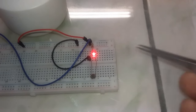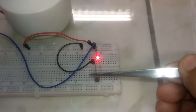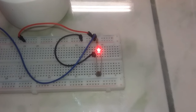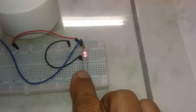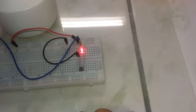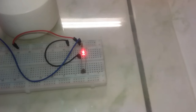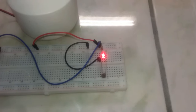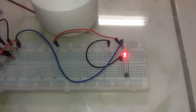A resistor is connected in series leading to the LED, and the negative goes through the LDR to light up the LED. The operation is simple: if we cover it, it is open; if we uncover it, it is open to the day and will be on, and at night it will be off. It depends on whether you need the LDR to activate during the day for your project — you can use it directly.